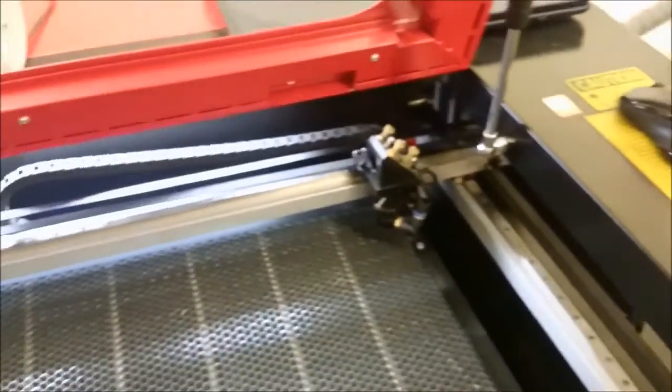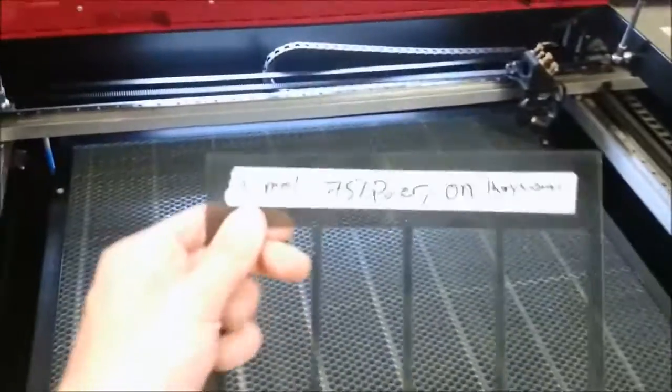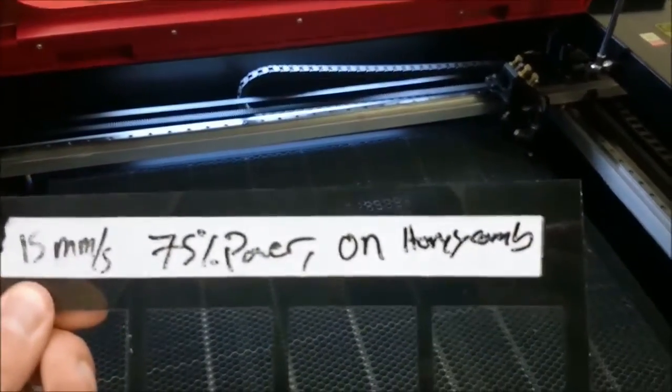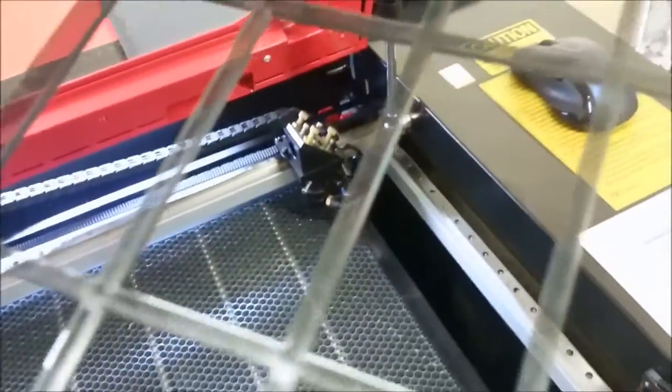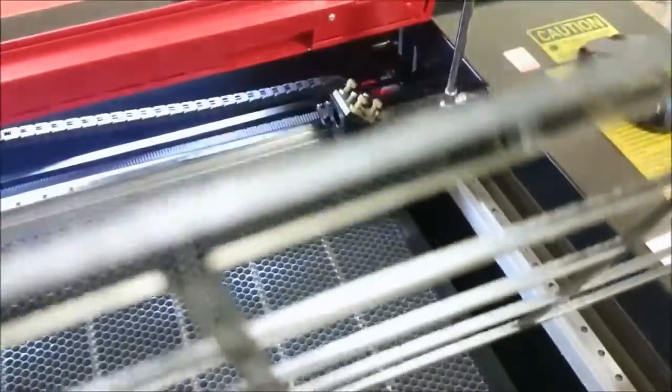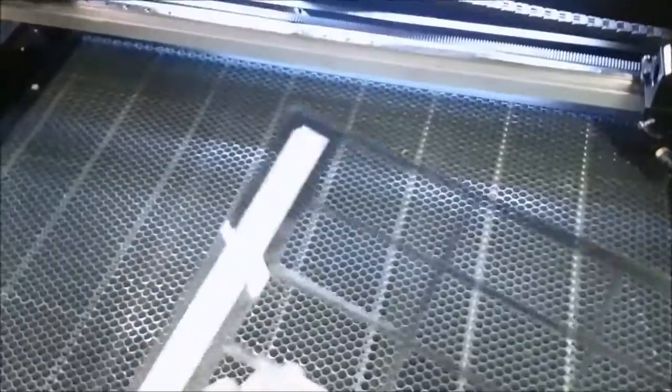It also has a big red button with a twist-to-lock. That's nice, and it actually works. Good to know that when you go for the not-quite-bottom-of-the-line tool, you get a little bit of safety. We are cutting at 15mm per second at 75% power on this. It's coming out pretty good. You're getting a little bit of flashback just when the laser reflects off these guys. But so far so good. Day one, pretty happy.